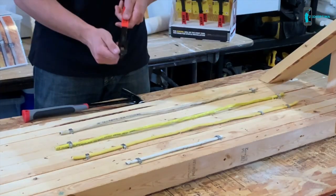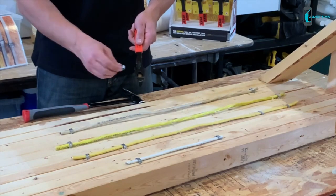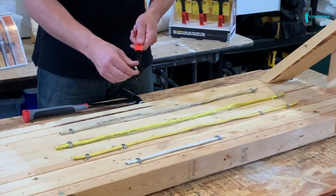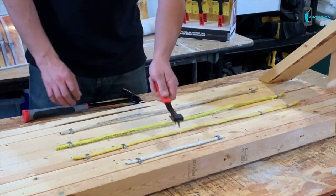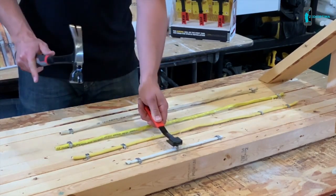Now, the Stay-Pal is made with a cross in the face so that you can put electrical staples either horizontally into the face or you can put them in vertically. And there's a magnet in the center of the Stay-Pal so that the staple, when put into place, will never fall out. Now, notice when I'm lining up to install the electrical staple, my hand is nowhere near the wire